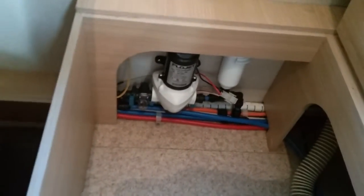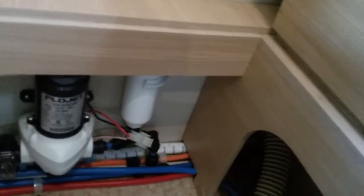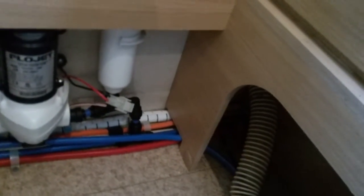If I now come to the travel seats just here and just remove the lower cushion — we have storage, but we also have the location of the water pump just here. The white part that just sits there is what is known as the surge dampener. It just helps alleviate any pump shutter.